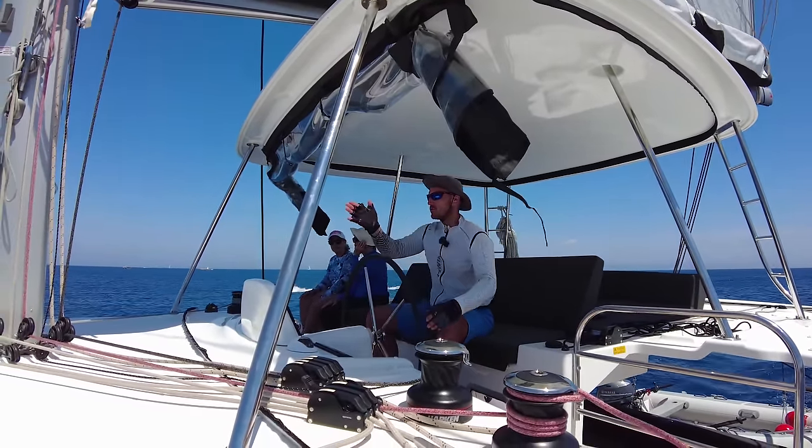One thing is when the anchor digs in and holds. But then also the weight of the chain and the friction and drag it has on the bottom add to the strength of the anchoring. The more chain you have on the bottom, the more friction there is. So it helps the anchor a lot, not dragging and holding the boat. That's why whenever I can, I just drop a lot.